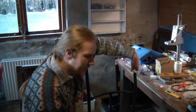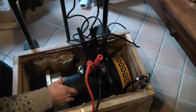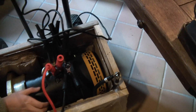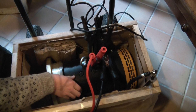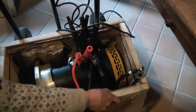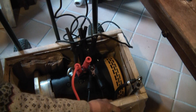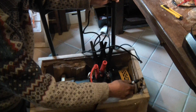Now I'm going to explain a little bit about the switching stator field. An electric motor is powered by an electromagnet which sits on the inside of both the static part — the stator — and the rotor, the spinning part connected to the shaft. These magnets can be connected in either series or parallel connection, and what the switching stator field does is change that connection, affecting the torque and RPM of the engine so you can economize the ride in an electric car.